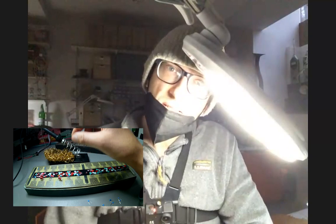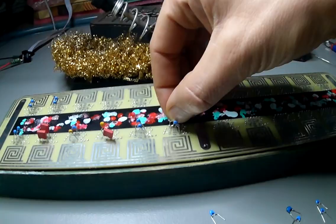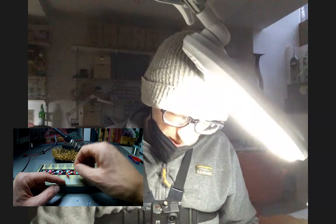Oh yeah, because it's an astable oscillator. You've got two sides, so two capacitors. If there's a smaller capacitor, that means there's going to be a tiny pulse there. Makes sense. A big fat capacitor takes priority frequency-wise. If there's a big capacitor, it's going to become a really low tone. Right. But it might be a pulse tone that's really low. And if you have two capacitors of the same size, then you'll get back to a square wave.